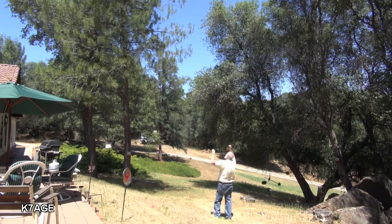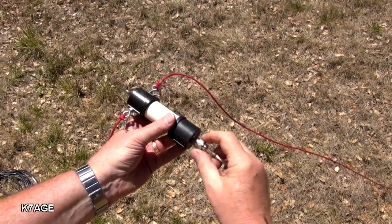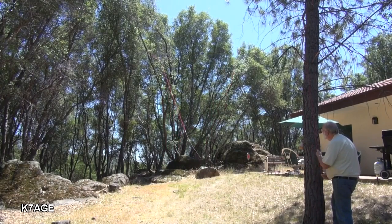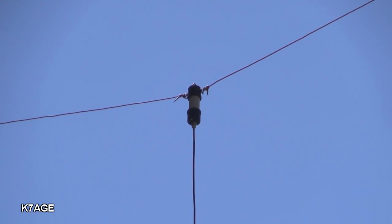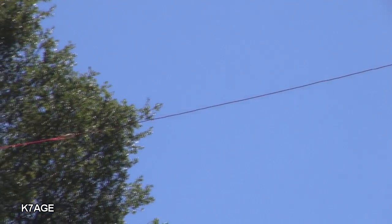I installed my antenna into a couple of trees near the house — I just threw the line up with the nut and pulled the antenna up, attached it with the coax. For the 10 meter antenna, you don't have to be super high. 17 feet up in the air is a half wavelength, so that'll do good. Also be careful not to put the antenna near any power lines for safety, or near gutters or anything that may interact. Having it out in the clear at 17 feet should work well.